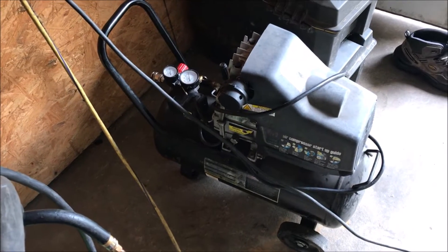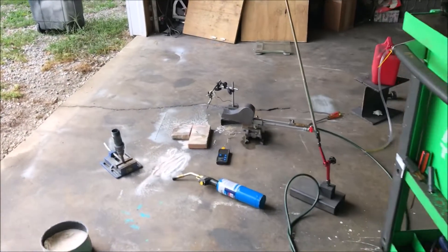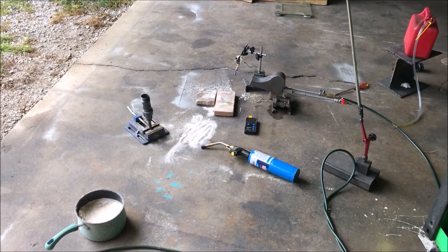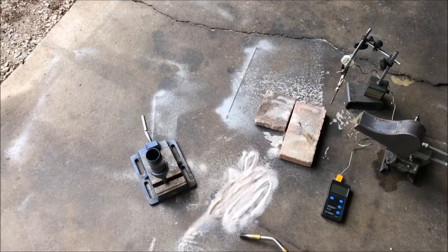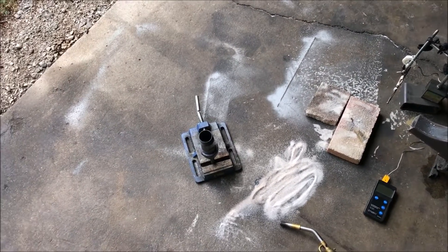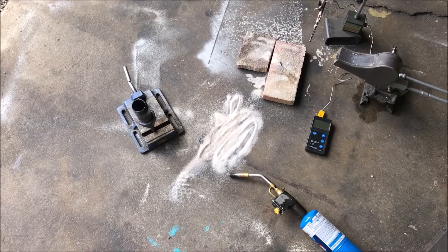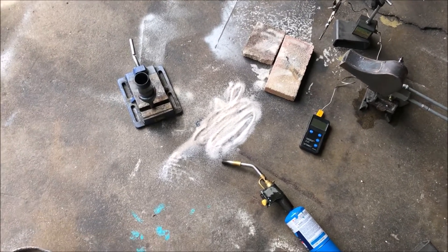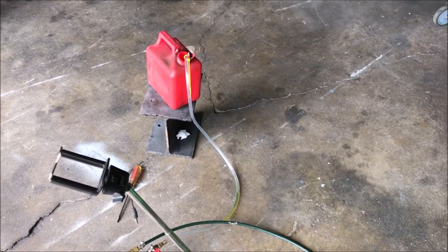As I said, once you're inside of a foundry, the infrared radiation coming off the walls of the foundry contributes massively to the heating of the substance you're trying to get hot. A small air compressor like this will do the job — I just didn't want to lack power during the test. We were still unable to melt the silica sand due to the low temperatures. Given more time, maybe something would have happened — I've seen videos where it can take a couple of hours easily. We ran for about 20 to 30 minutes and used about a half gallon of diesel to do that.